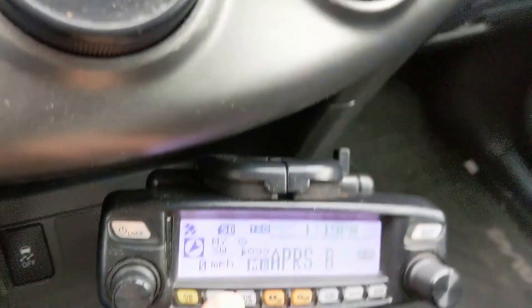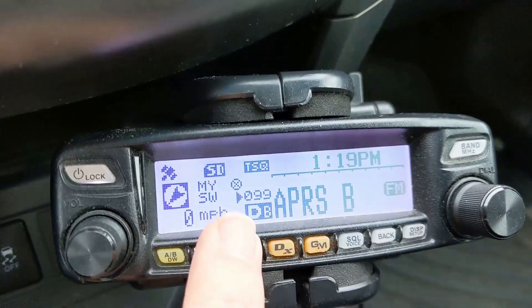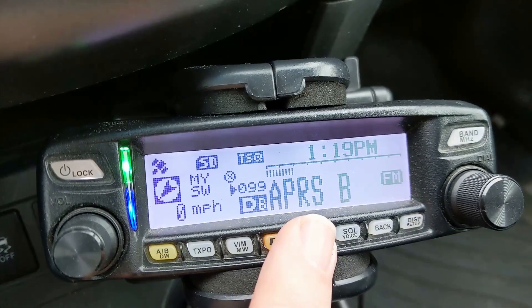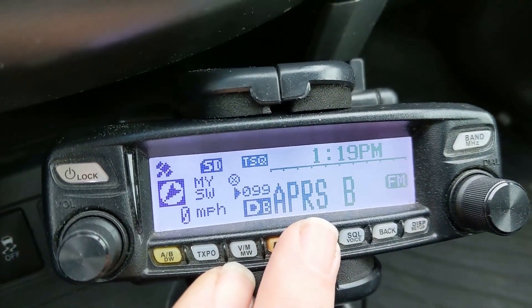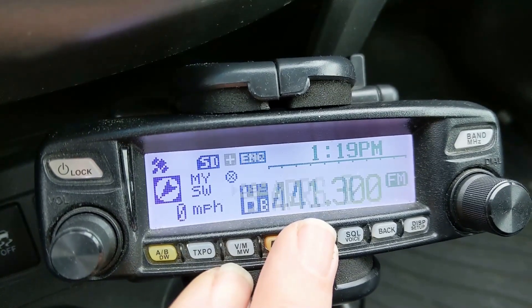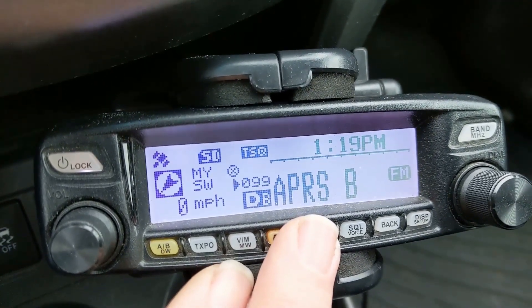So what I can do is while I'm on APRS, I can hold down this button right here, and it's going to go — the M's going to turn into a D. Now it's dual watching. Now if you watch APRS B, it's monitoring packet full time, but if someone talks on my home station, which you can set in the menu entry here, it'll lock onto that and let me talk there. So every now and then you'll see this thing flip over to the other VFO just for like a fraction of a second.